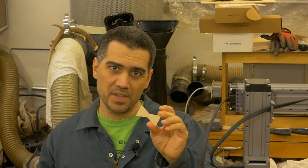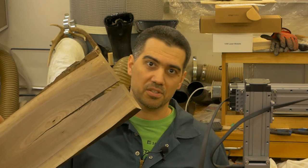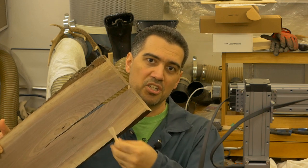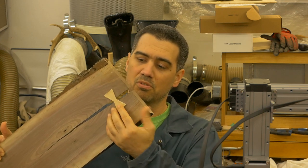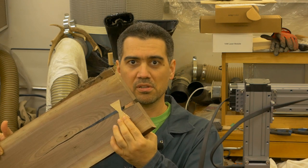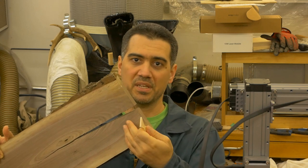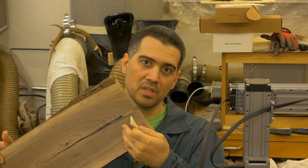Hello and welcome to my workshop. In this video we'll be making butterflies, or little bow ties, using the CNC. These little butterflies are perfect for preventing the spread of a crack in the wood. You find the direction of the crack, do some magic, and the little butterfly gets placed in a perpendicular direction. The conical shape of the butterfly forms a mechanical bond with the wood and that prevents it from further splitting apart.